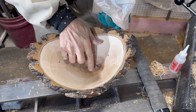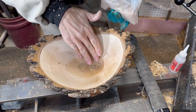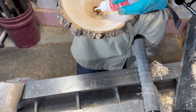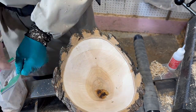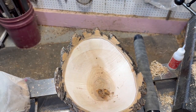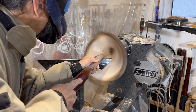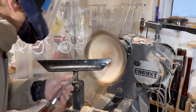There was another little area in the very bottom that needed to be filled — a little crack. The easiest way was to actually take the piece off the lathe and use walnut dust again, because it was in a little knot, and just drop the CA glue in that way so it doesn't run down the side of the bowl. Because all the turning was already done, I'm just going to use a negative rake scraper to take the high spots off from the CA glue and dust.